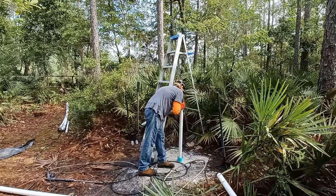We need to prime this guy first. So let me do that. And the way I'm going to prime it is I'm just going to put the garden hose right in here and let it run back and fill up that section of the pump. Okay, the way I'm going to prime it is I opened up this valve that they already had there, and I'm just going to tilt it up and fill up this thing with water. I already brought the power out, so I'm going to plug it in. We'll see if we get any pressure or if it even works.